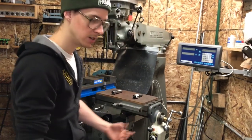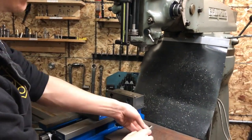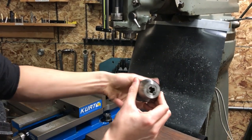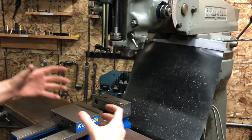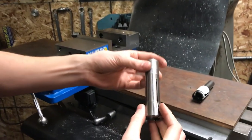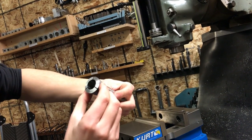When you're going to make bikes, you don't need to switch them back and forth. On the machine here, we have the spindle and you use collets. On a drill press, you might use a drill chuck — it's a three-jaw chuck that scrolls in and out and can hold up to a half-inch shank. But on the milling machine, if you want to take advantage of the rigidity, you want to use a collet. This has a taper on the outside and threads on the back, and as you pull it up into the spindle, it wedges on that taper and grips onto your shank.